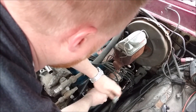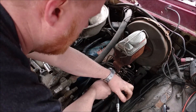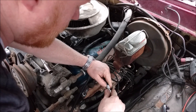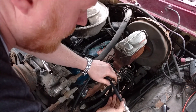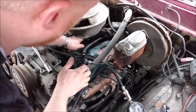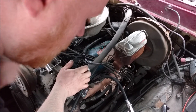The idea is you just screw in the gauge once you've got the right adapter on there. The kind that disconnect are much easier because it just allows you to wiggle everything in easier. Put it all together. I like to put it somewhere where I can see it while I'm in the cab, because you need to crank the engine with the throttle pushed wide open. So we'll sit that right there and get a crank.